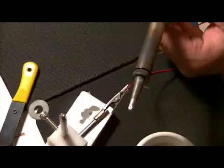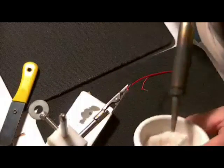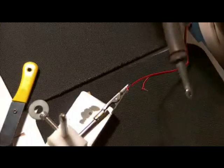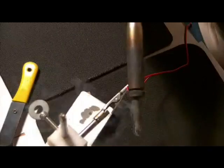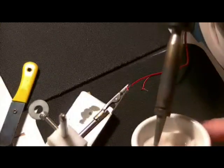I think a fat tip is the best, but you can use a fine tip if you want to. The method is still the same. Make sure your tip is always clean — I use a wet sponge to clean your tip. Then you want to tin your tip as well. To tin your tip, you just add a couple drops of solder to each side, and then get the excess solder off again by using your sponge.